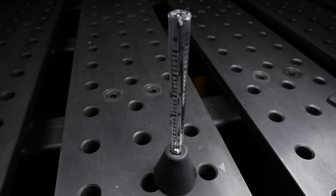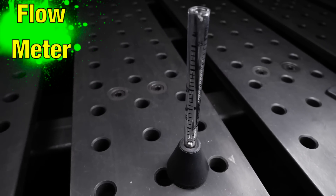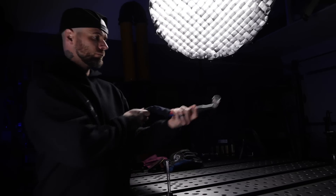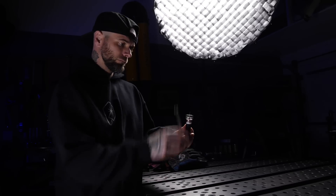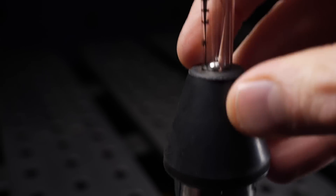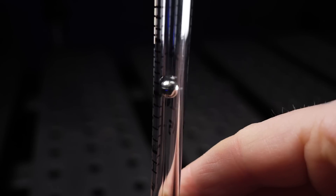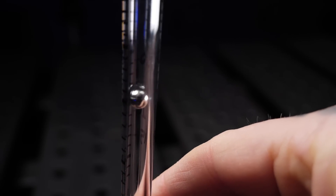What you're looking at here is called a flow meter. It's kind of funny that at the time my shop didn't have one — they're pretty cheap and completely worth it to get one. After getting one just to double-check everything, you place it over the end of your TIG torch like this, safely activating the gas through your torch. You can see that the gas activates the ball readout, and holding it vertically, you can see exactly what your torch is outputting for gas volume.